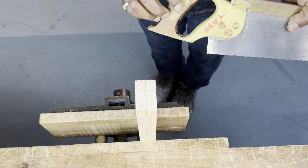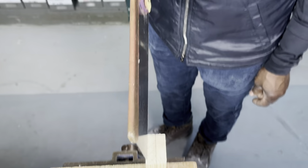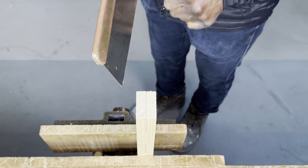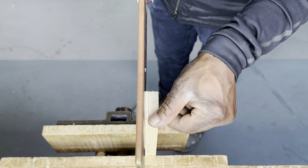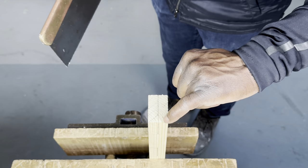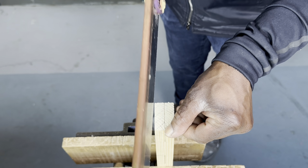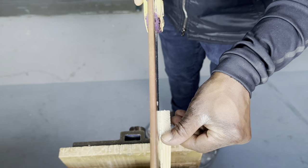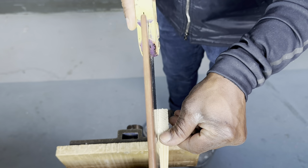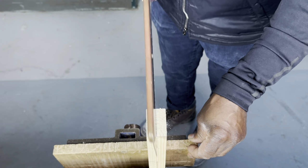The first procedure is that you place the saw on what we call the waste side, which is the side that I was shading. I'm going to point to the waste side with my thumb. The idea is to try and cut the gauge line. This is a gauge line, and what you're trying to do is use the tenon saw and split the gauge line. So I'm holding my thumb as a guide, 1, 2, 3, and slowly and easily just score along the top of that.